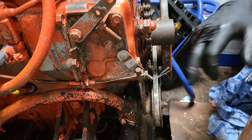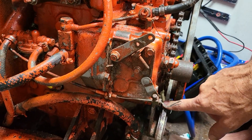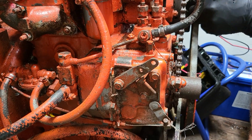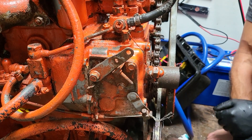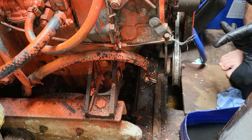I'll just do it up so that's got a bit of tension on that belt. You've got to regularly check the belts on these — don't go crazy because it's got small bearings. Like, if it's not slipping and it's charging, that's enough, otherwise you just heat up the bearings. Impeller's done.